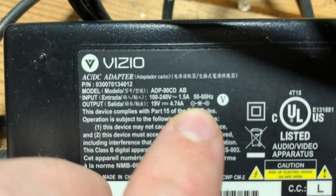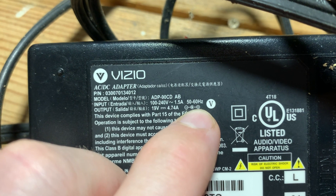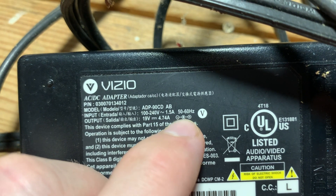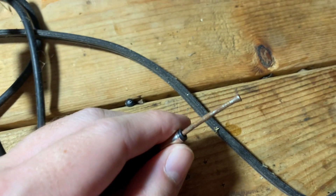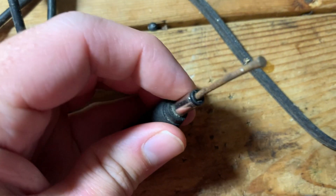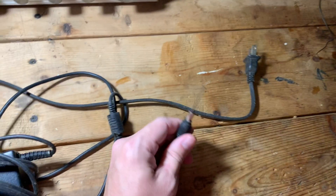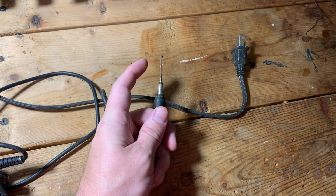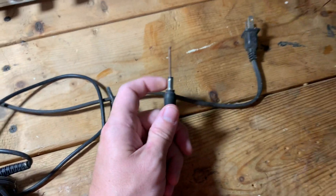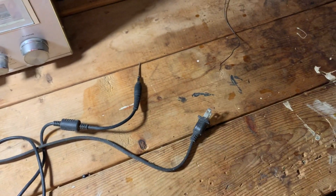You can read this symbol on the back — the outer sleeve on the plug is the negative side, and the inner part is the positive. What I've done is wedged a steel nail into the plug that should be making pretty good contact with that positive terminal inside, and the outer sleeve is the negative. We'll hook everything up to the sacrificial anode and the griddle top appropriately, and once we've got the baking soda and water set up, we can run it. I need to get some alligator clips though.